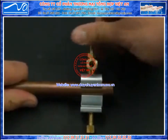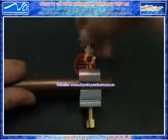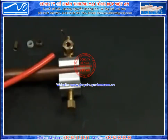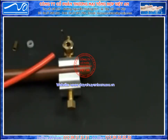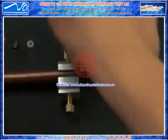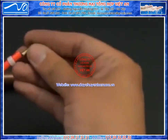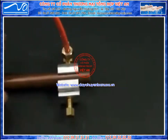Now that it's properly installed, we'll twist the knob, which will drive the pin down into the pipe and make your hole. When you have it all the way to the bottom, we're going to reverse the pin back out so water can flow through the hole. The last step is to attach our red water supply line to the saddle valve. The unit comes with three small parts. The small brass part we're not going to use because that's for rigid copper line. Go ahead and unscrew the brass nut and then slide it onto the hose. We'll then take the plastic ring and slide it on as well — make sure the thin side of the bevel is closest to the end of the tube. Insert the brass insert and screw onto the saddle valve. You've now made a permanent attachment to your home's water supply. Please note that you have created a permanent hole in your copper pipe and don't install the saddle valve unless you are comfortable with this.